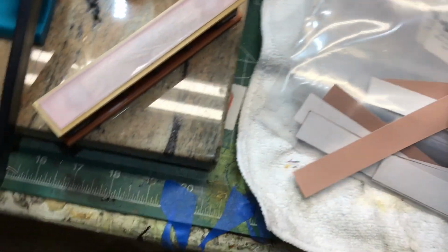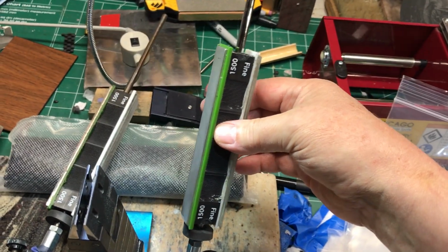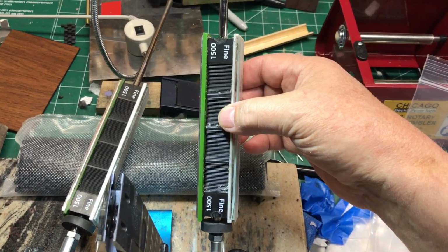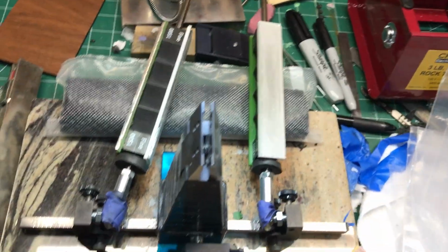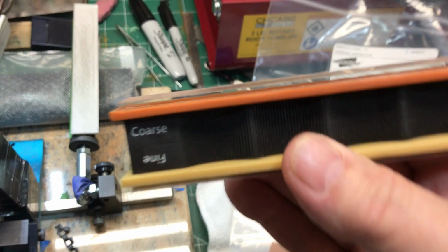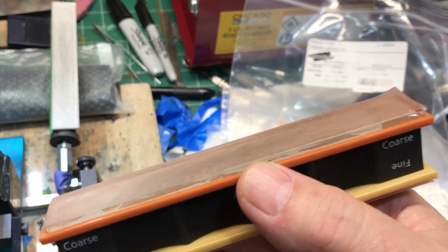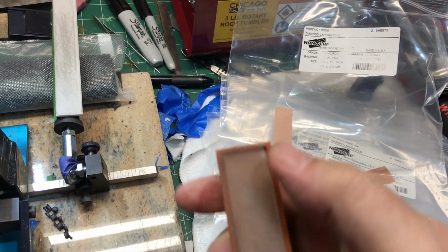So anyhow, what I use then is either on my 1500 diamond grit. It has a glass platen on it. This happens to be 1 micron on here. And I also have a couple sets of these. You can see the glass right there. So it's just a matter of cleaning the glass off. This edge is coming up a little bit. I didn't clean that as well.